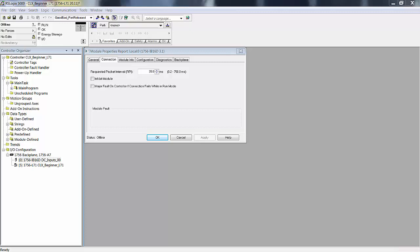You need to think of the backplane on a 1756 chassis as a 32-bit parallel network instead of a serial network like Ethernet or RS-232. Well, RS-232 is not a network, but it's serial. It means you have one line level that goes up and down at a baud rate to communicate. So you only communicate one bit at a time. Ethernet, DeviceNet, ControlNet, whatever. It's one bit at a time. It's serial. The backplane of a 1756 chassis is a 32-bit parallel network. And everything that plugs in to a 1756 backplane is capable of communicating on the backplane.